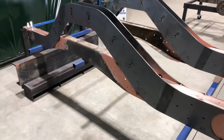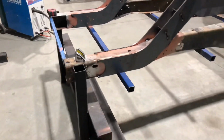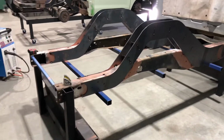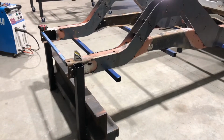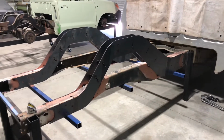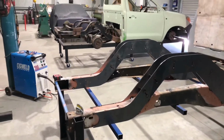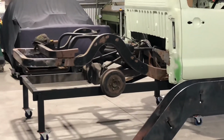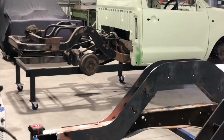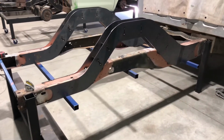If you're curious what these offcuts of PFC on the floor here are for, I'm using those as a counterweight. Basically the rear half of the chassis is on legs, squared and leveled at a certain height, and I've stitched these pieces of PFC to the legs to use as a counterweight, because once I weld the whole rear of this chassis with all the strapping, the chassis is actually going to want to bow upwards. If you look at this Hilux on the table, you can see that the rear half of the chassis from where the notch has been welded is sort of kicked upward. So the reason for that counterweight is to stop that from happening and keep the chassis where it needs to be and where it should be.